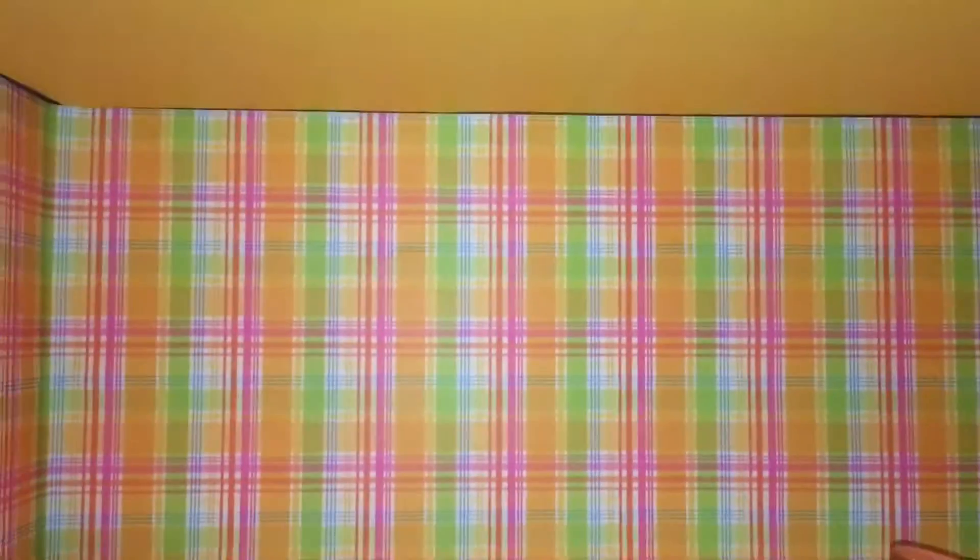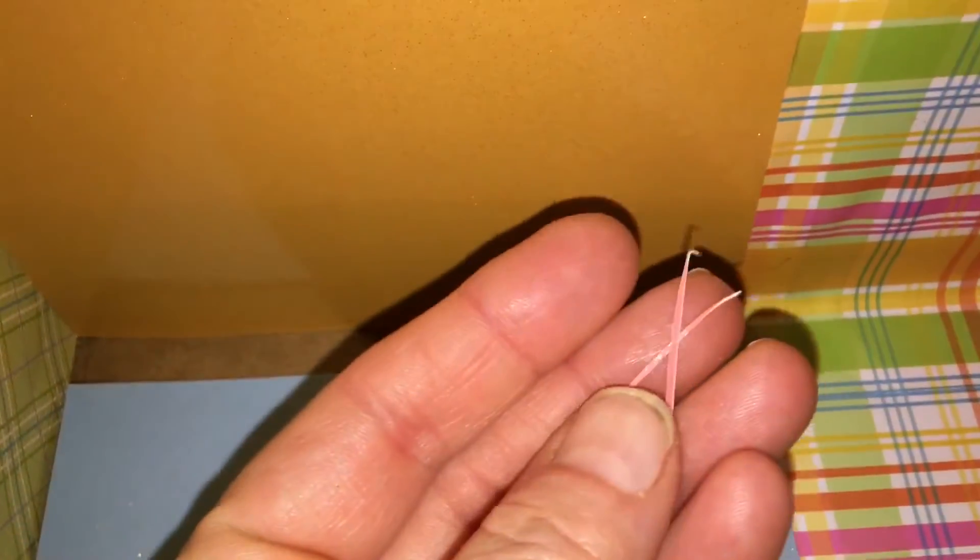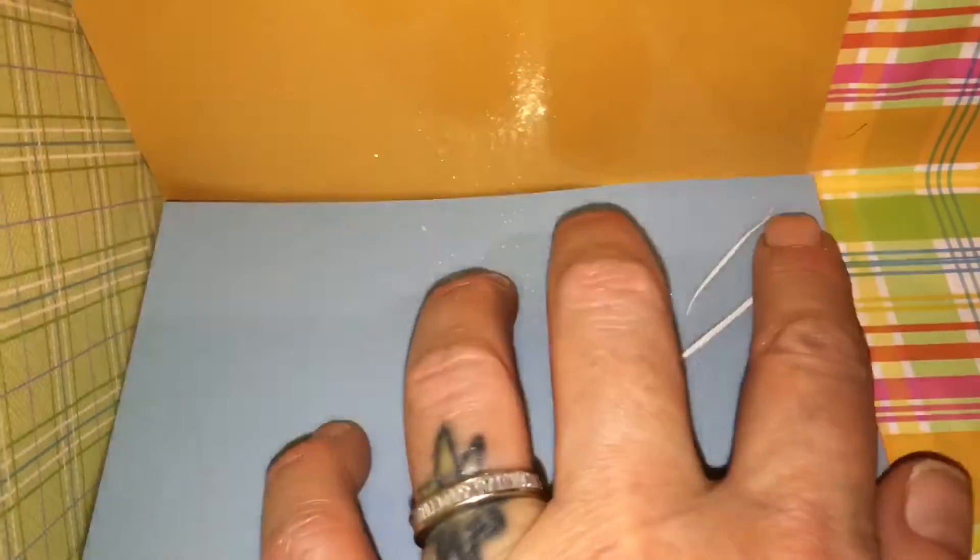When I get over to the right and left edges I'll just cut the panel a little shorter but still keep my symmetry going through the rest. Here's the room at this point and I'm really loving these colors. Now we're getting into the corners — sometimes the corners of the boxes are not very even, same as in wallpapering. You just match it up, take a little pencil line, trace close to where you need to cut, and do it in portions — cut a little sliver off, match it up, repeat.